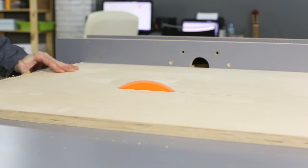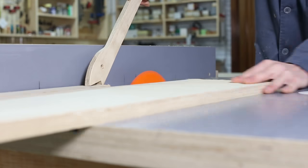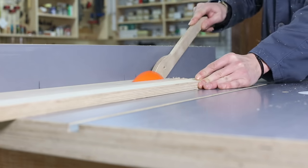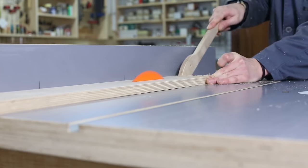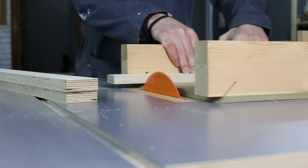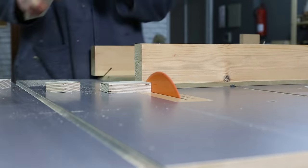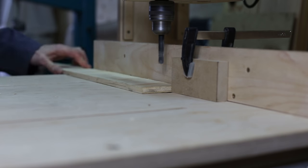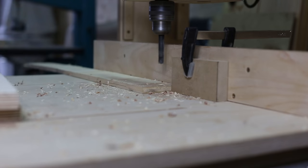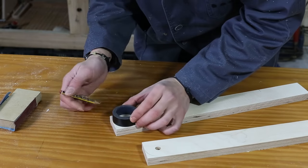Here I'm cutting the feet off parts. Then cut and drill the frames for the hinge covers. Make the hole for the steel pipe so it fits slightly loose, as it is the axis of rotation of the hinge covers.